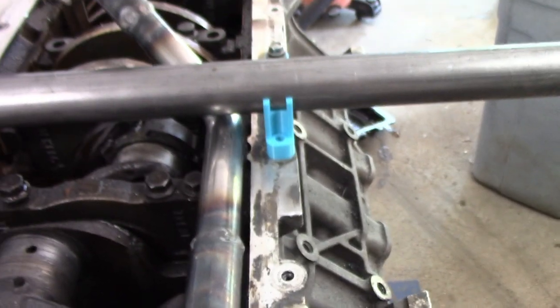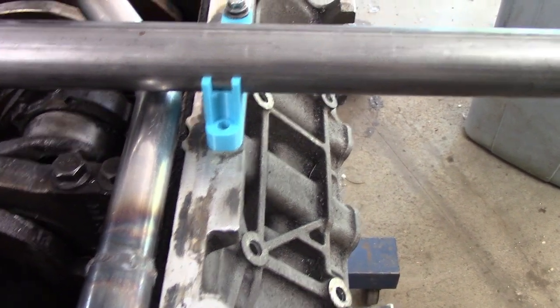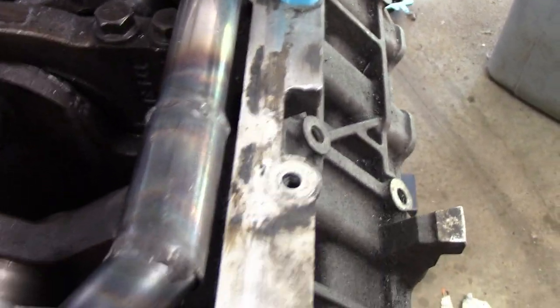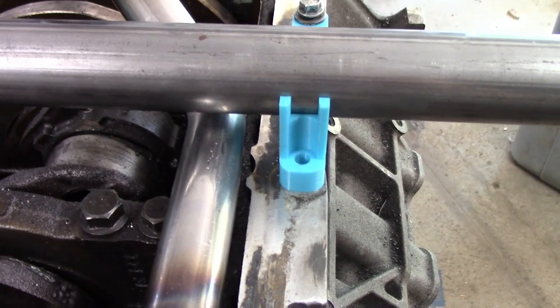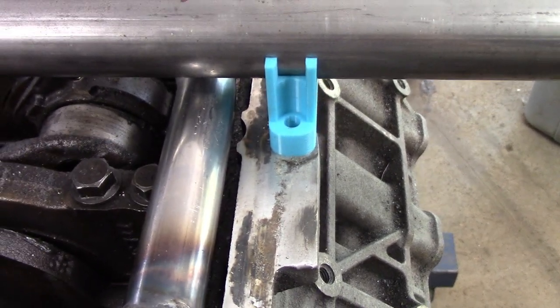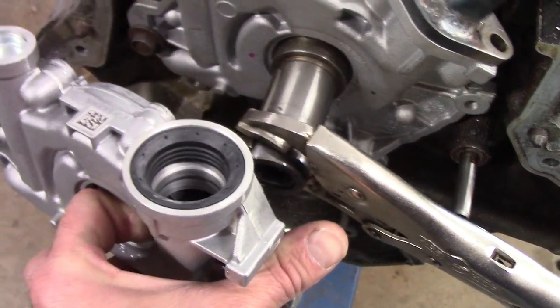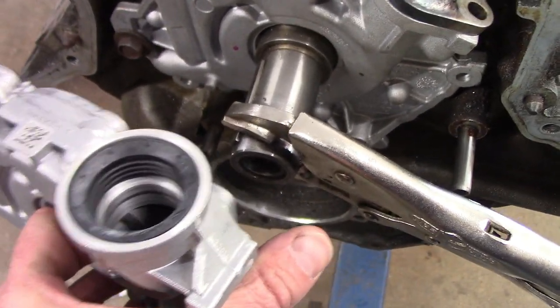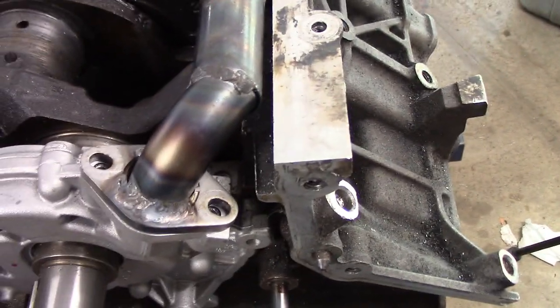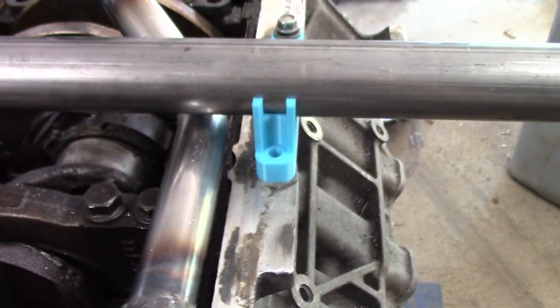But once I actually made the oil pan and kind of mocked up the jack shaft, like you see here with these 3D printed parts, I realized that there really is enough space underneath it, well, underneath in this one it's upside down, above it, to run it above. So, rather than spending a whole weekend or maybe more taking the whole front of the engine apart just to put this oil pump in, I decided to leave the stock pump in it and run the F-150 gasket and just make my own oil pickup tube, which goes above the jack shaft.